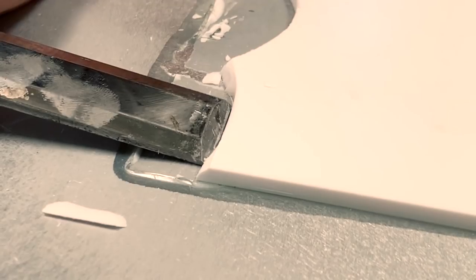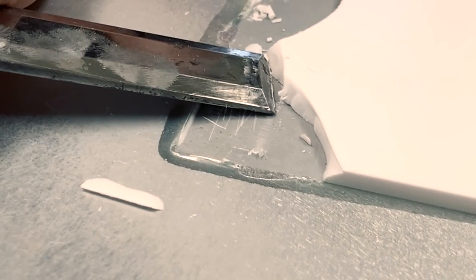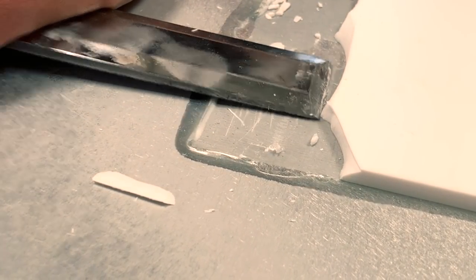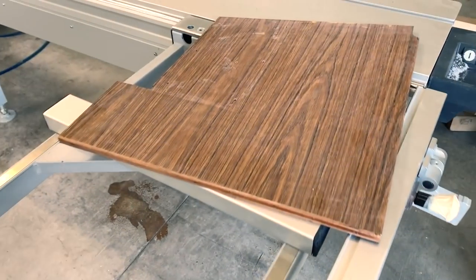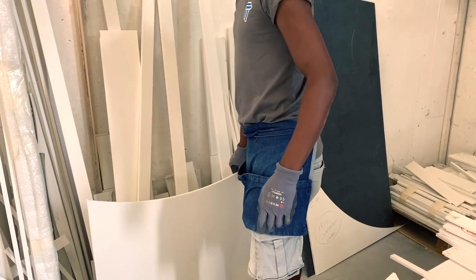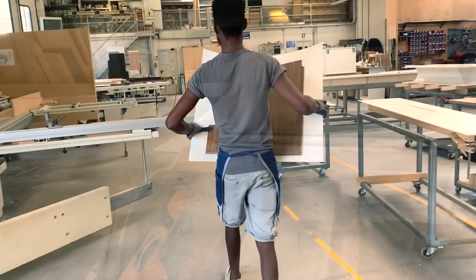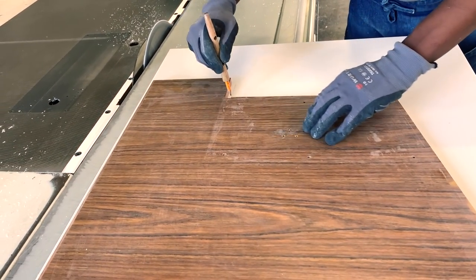My concept in making the new engine cover was to get something lighter. We know that Corian weighs so much, so I decided together with Franco to use a very thin layer of Corian glued on an aluminum honeycomb panel - the panel normally used for construction of helicopters and floor structures where weight is very important. We glued the Corian and the result was a success. Isa helped me to find the correct color to match what I already installed on Alos in the kitchen, and we need to make the same size as the original lid cover.